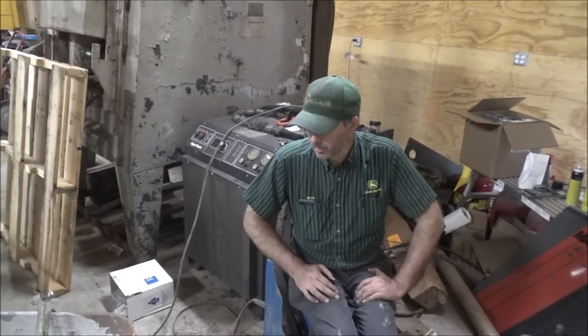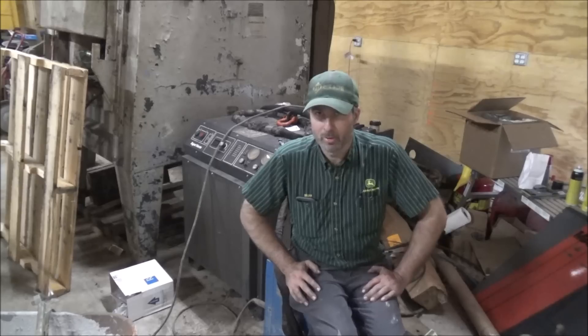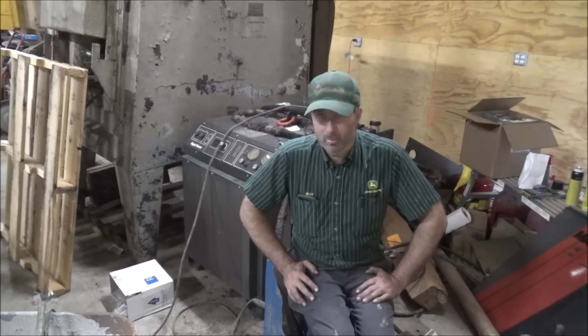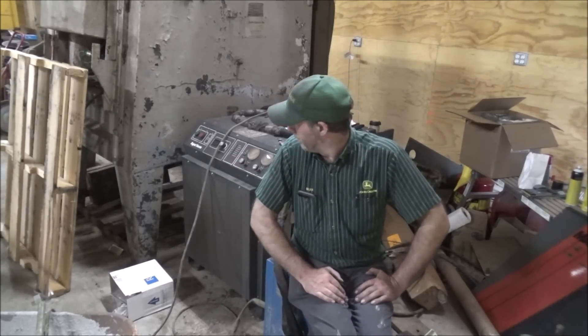So I've got the new switch here and I'm going to show you how I put that back in the torch assembly. Once I get that done we'll be ready to fire this thing up again and see if it works. I'm going to run some wire back over here to get it plugged up — I'll just rob it off the Monarch and drag it over here and plug it in. This is 480 volt 3-phase, just like it was.